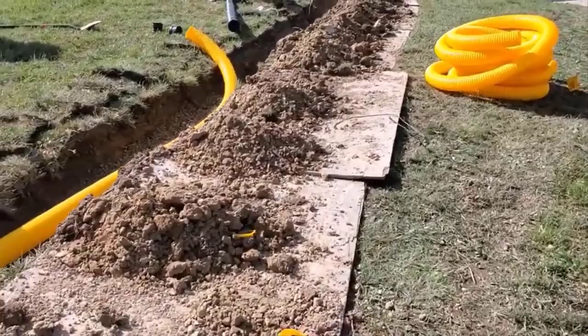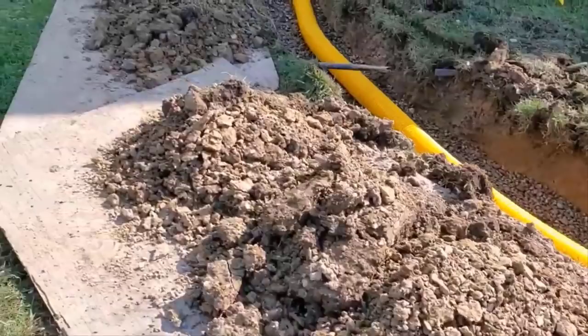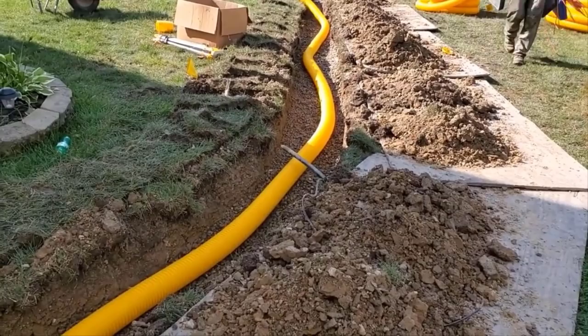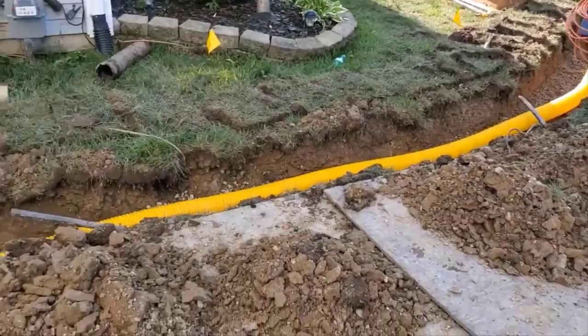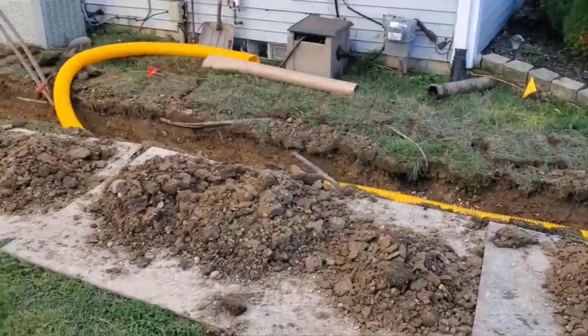And when this leach system can't contain all the water and it gets overwhelmed, then it goes to the overflow. And that's when it'll actually send water to the storm sewers in the street. But for the most part, for your typical rains, you won't even see any water make it that far. The collection reservoir and the leach field reservoir are just too big.